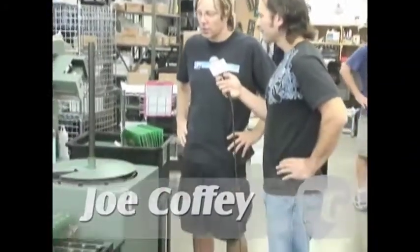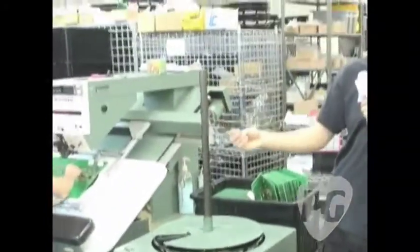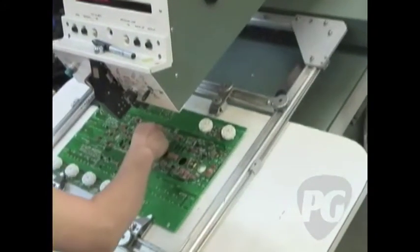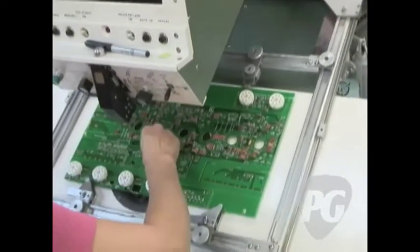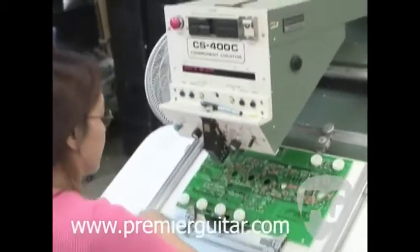Now we have non-uniform parts being put in. These are components of widely varying size — filter caps, relays, sockets, LEDs, a bunch of different stuff. There are machines that could install all of these oddly sized components, but they would take up the size of this whole room. This machine here is not totally modern, but it's totally appropriate for what we're trying to do. There's a sequence in the brain of this machine — it moves the board to where a part needs to be installed. A blinking light indicates polarity, and a static light tells the person where the component will be installed. When a component gets installed, the bin spins up and opens to the next component.